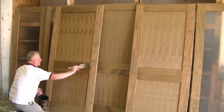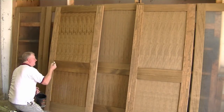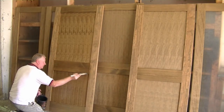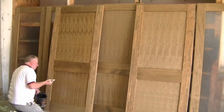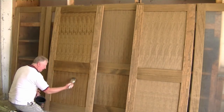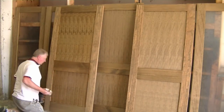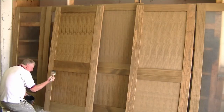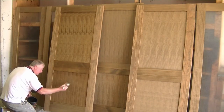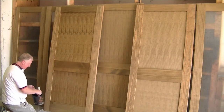You go back and look over here — I see a few sags. Sags through here, sags all over. So you kind of go back. You don't want to leave those brush marks going in the wrong direction. Check your panel — a few sags there too. It's an extremely runny product.